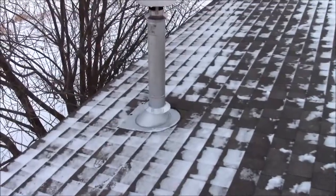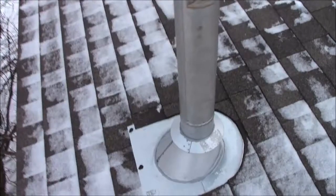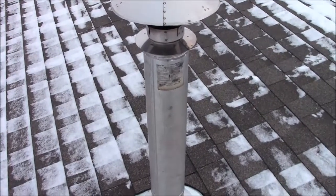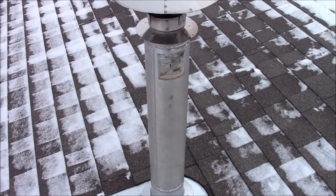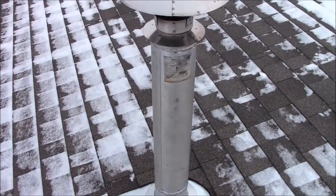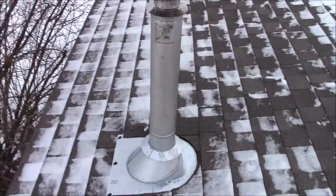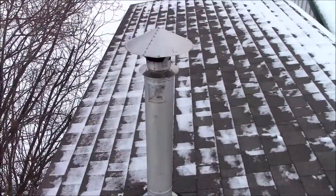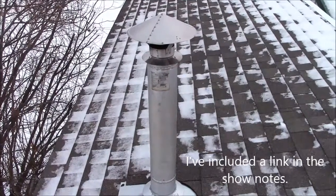I'm up here on the roof of the house and I thought I'd do a temperature check out here as well. So far we only had that one surprise with the wall, so we're probably going to get a bigger guard — though that's not an emergency. That 70-degree temperature threshold is a long-term concern. It has been a recorded occurrence where over years and years of being exposed to 70 Celsius temperatures, the wood can actually spontaneously combust at a lower temperature. I'll try to find some links — there are actually studies published on that. So not something we need to worry about over the course of a couple of months.